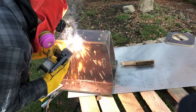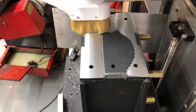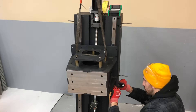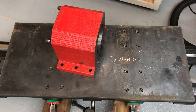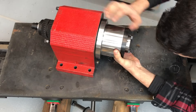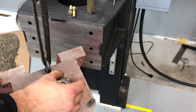Don't forget the spray paint! Next we surfaced the critical face to make it parallel to the back, and it was now ready to accommodate the spindle block, which we had also finished machining and threading. Finally we slid the spindle into the block, aligned the holes, tightened the screws, and the assembly was ready to be mounted onto the column.